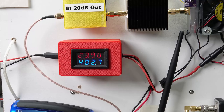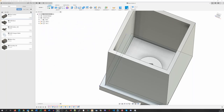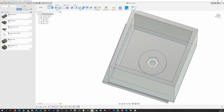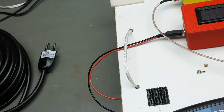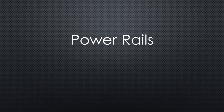There is one exception — this volt-ampere meter is on the top because I want to see it from the outside. To get the needed clearance, I printed four feet and mounted them with screws. Screws are a reliable method, and if you do it like that, mounting is easy because the nut stays where it should. You can also add a little superglue, which works well with PLA. I also added four holes and two cords so I can remove the whole setup easily.